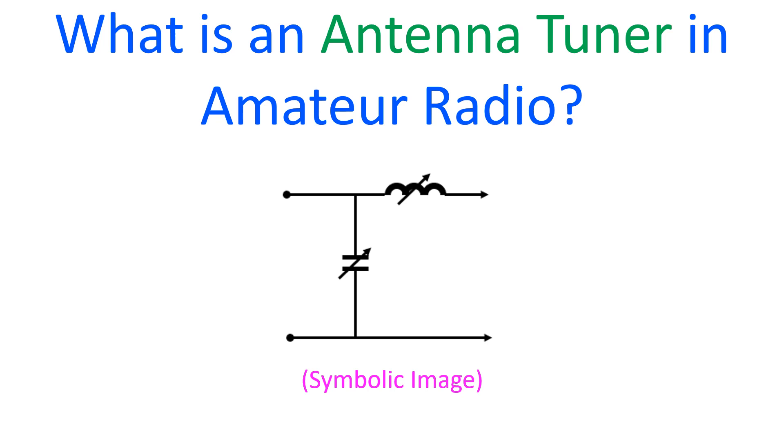When the antenna is mismatched, there will be high SWR leading to low radiated power and heating up of the final RF power amplifier as well as the feeder coax. It is always better to have good impedance matching without the antenna tuner, with the antenna tuner being used only to adjust minor mismatches.